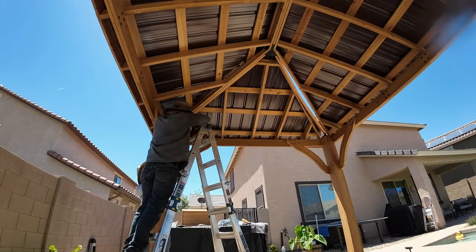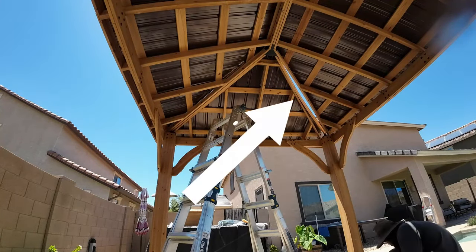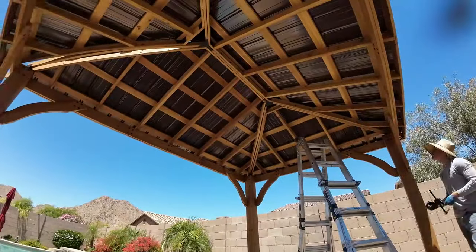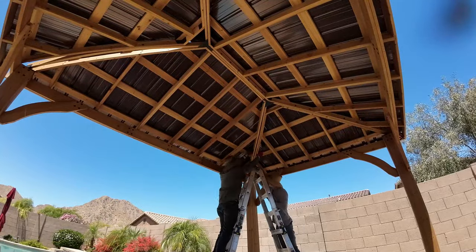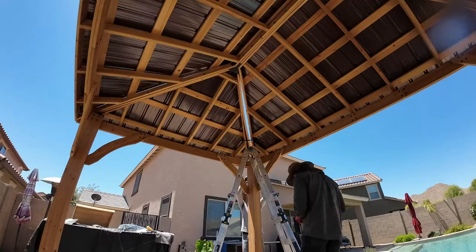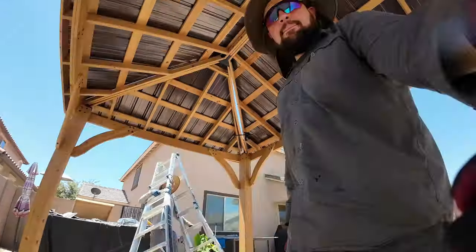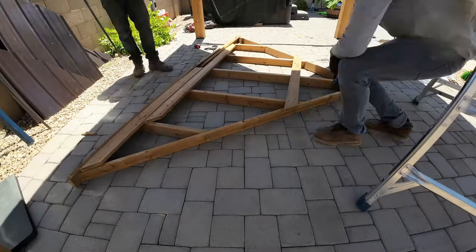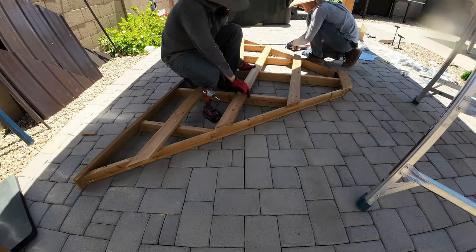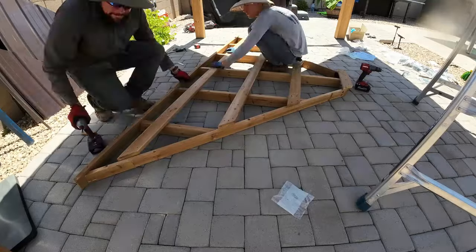My recommendation is just to take it a step at a time, do your best, and as long as you follow the instructions and don't skip anything, you will be okay. You see that gap up there on the right top corner where the arrow is? That little mistake I made earlier with the roof panels caused that gap, and I could not get it together. It took me about 15 minutes just messing with it trying to figure out what was going on. When I went to the other side, I realized the bottom wood I had screwed onto the frame was not lining up. So we had to take everything down and redo it — that cost me an extra hour easily.